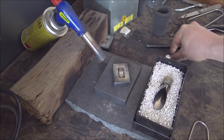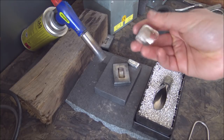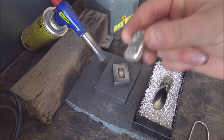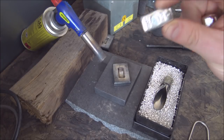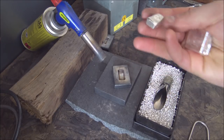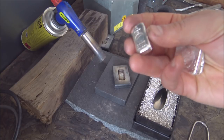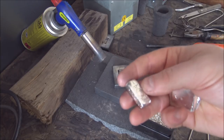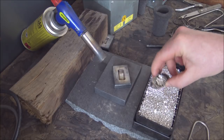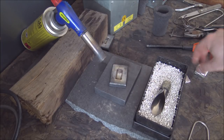The way we produce those ripples is interesting. I get asked every year why we do the bars the way we do them. I pour these by eye, by judgment of how much one ounce is going to be. It causes a lot more work because the number of times you're over or under is considerable, and there's always a weight allowance of around five percent maximum. A lot of people ask why not weigh out exactly one ounce of casting grain, put it in the graphite crucible, and pour it all into the mold.